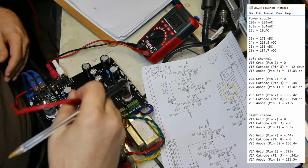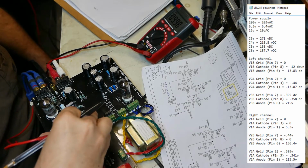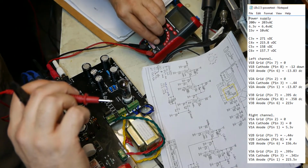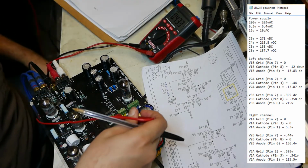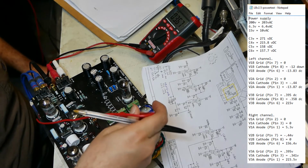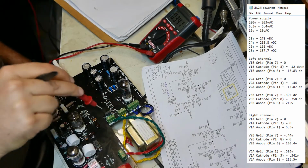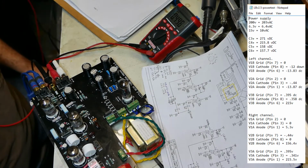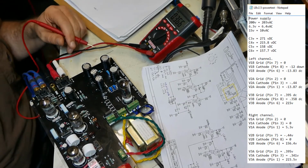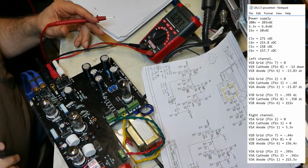But if I go back to the green 15-volt wire, oh, that's AC. Sorry. VAC. Yeah, still 10 volt, 9.93. And the other side of the same thing. Both green wires going in is the same. Dang, I mean, I don't know if my transformer's dying. Quite possible. Alright, so the next on the list is left channel V1B.